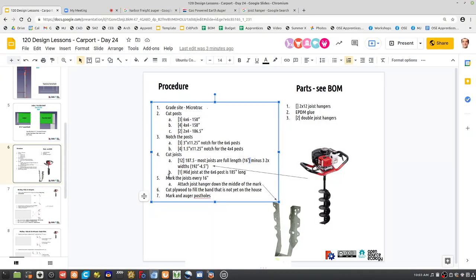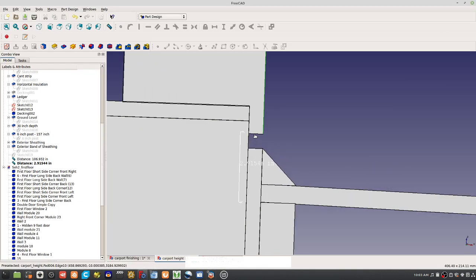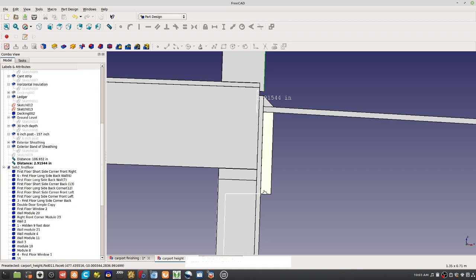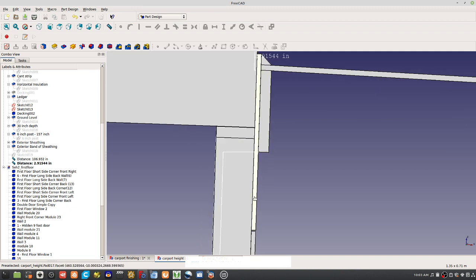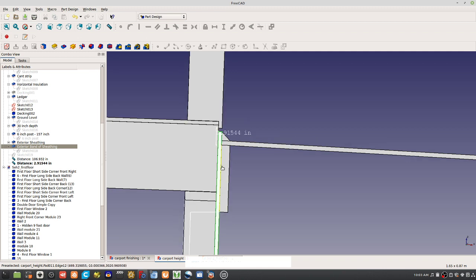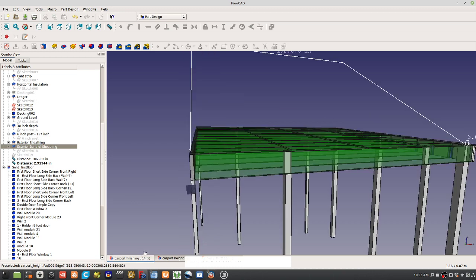I would say we take the... since 24.25 and 24, that's pretty similar. This gap here that we have, we can make it slightly bigger. That's perfectly fine. So if we make this here actually 24 inches, we're not wasting any material. So cut 4 strips of 24 inch for the siding that we have.